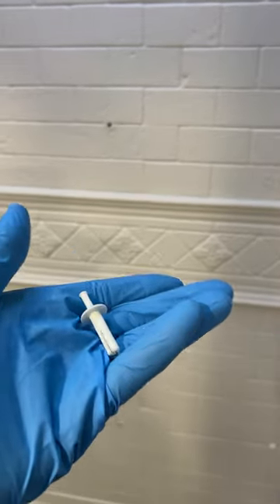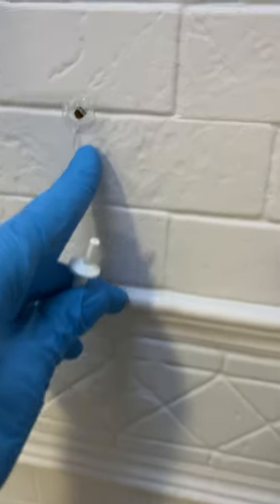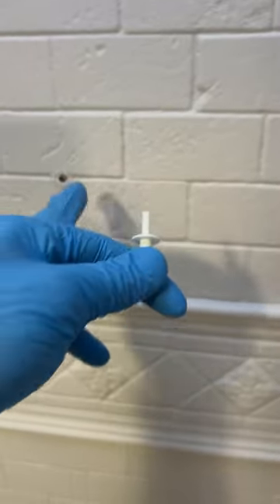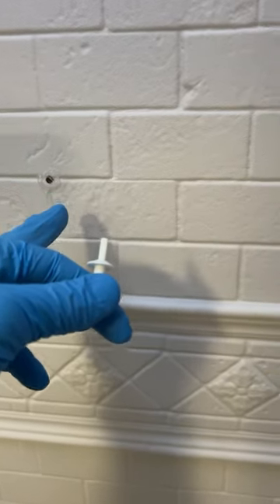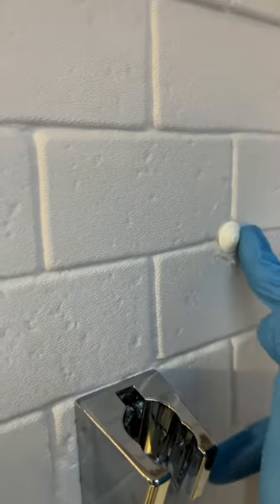If you're putting some of these ribs in your shower to hold the surround in place — one came with it from factory — they had the ones that push in there. When you put them in, put a little bit of silicone around them so it seals behind there, because this flat washer is definitely not going to seal on those ribs of this little brick-looking material. When you get done, you clean it off.